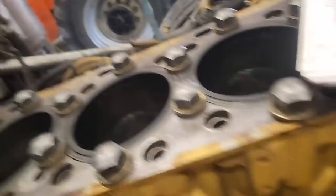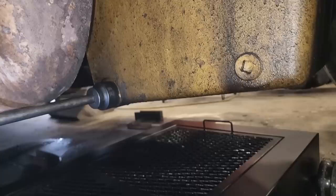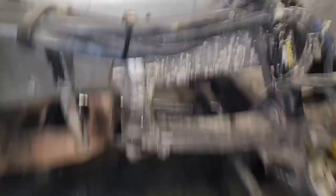I know now what I must do — we're going to be pulling the cylinder packs out, some extremely graphic mechanicing. We need to drain the oil out. He did have some coolant — not a ton — but there are signs of moisture in the oil, so he's going to be getting new oil. There's actually quite a delay between finding out the liner protrusion was off and draining the oil, because once we found that, we had to quote him for what we were going to be doing. We also found some excess silicone on our sump. It's common when people use too much silicone that it winds up in the oil pan, and you don't really want silicone stuck in your sump. That was pretty much the end of this day.